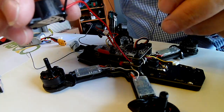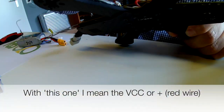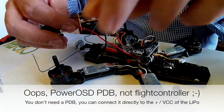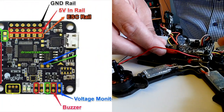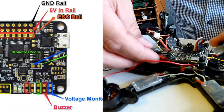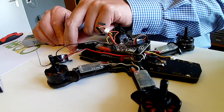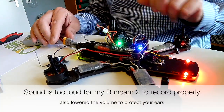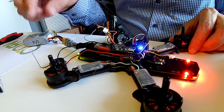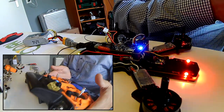Knowing that flight controllers typically switch the ground signal only, you can just connect this one. I've connected this one to the PowerOSD flight controller over here — it's actually just connected to LiPo power on the plus side. So if I then connect that to the ground on the buzzer — that's the one closest to the board, as you can see over here — and then I fire up my quad again, you will hear some different noises. This one has had some wear and tear already, but it's still quite loud as you could hear. So if I put it in buzzer mode now, it's actually quite loud.